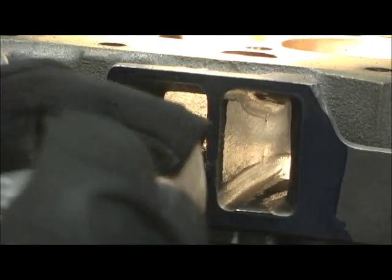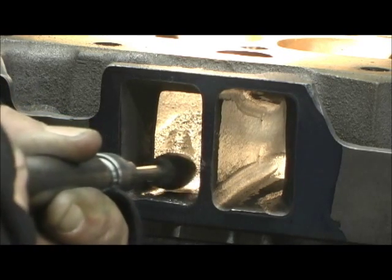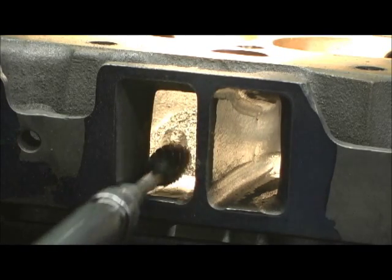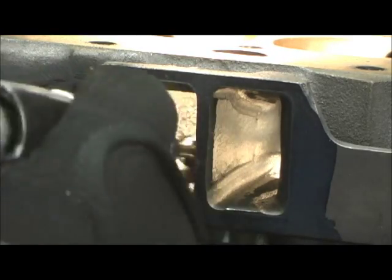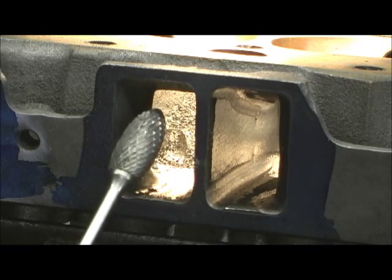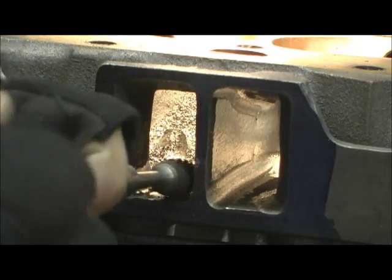A little more pressure because you have to come all the way to the end. Notice how I find the tallest hump and keep it centered — I'm not letting it beat on the sides except just a minor bit. This burr removes the most bulk material of any cutter I've got. It's really a beast to hang on to, and I don't recommend trying one of these until you know what you're doing because you'll tear them up. I've already got a couple of teeth missing, but that's typical.